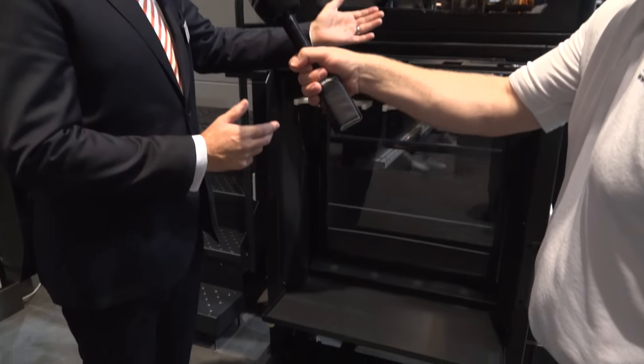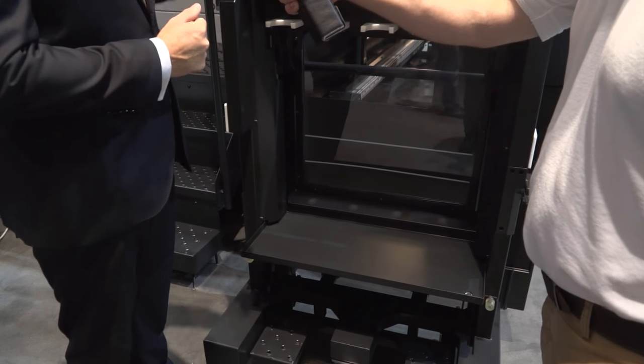So what's this? Well, this is an element of the Tool Tech — this is called the tool cart. The tool cart can house up to five tools and has been designed so that tools can be taken very easily out of the machine. By automation, the magazine will load into these five spaces here, so you can accommodate very heavy, large tools that are normally very difficult for the operator to remove. This can then be transported directly to another machine or taken to a tool pre-setter where tools can be refurbished and remeasured and brought back.